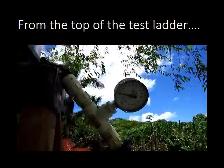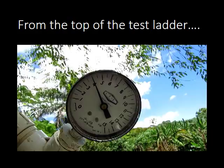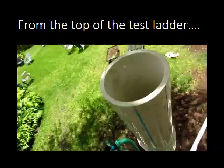We're now at four PSI — we lowered it one PSI — and we almost doubled our time. So with a pump that can do five PSI you do great, and you're getting super aerated water coming up here, as you can see — coming up big time.